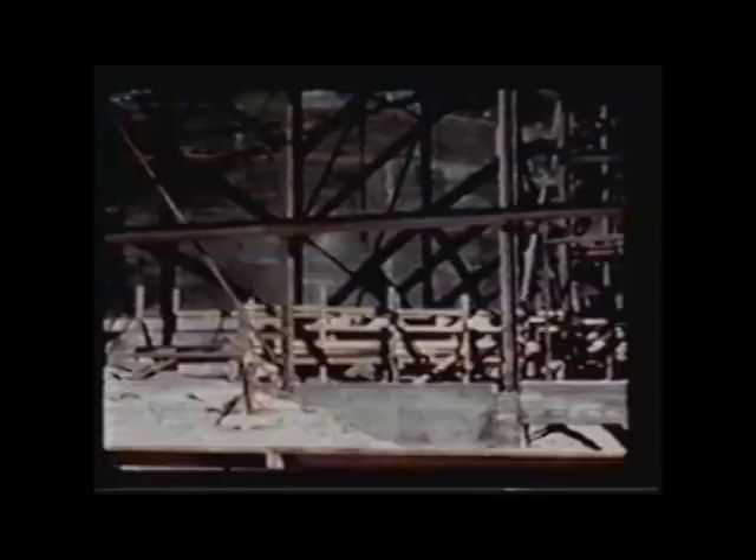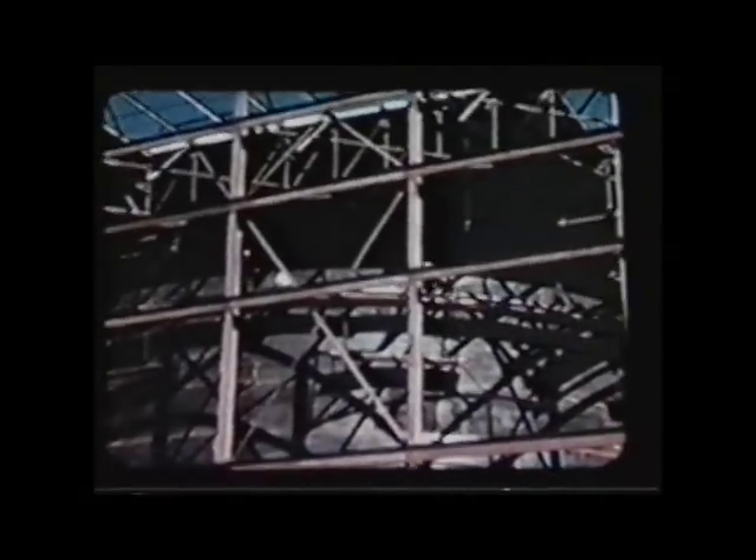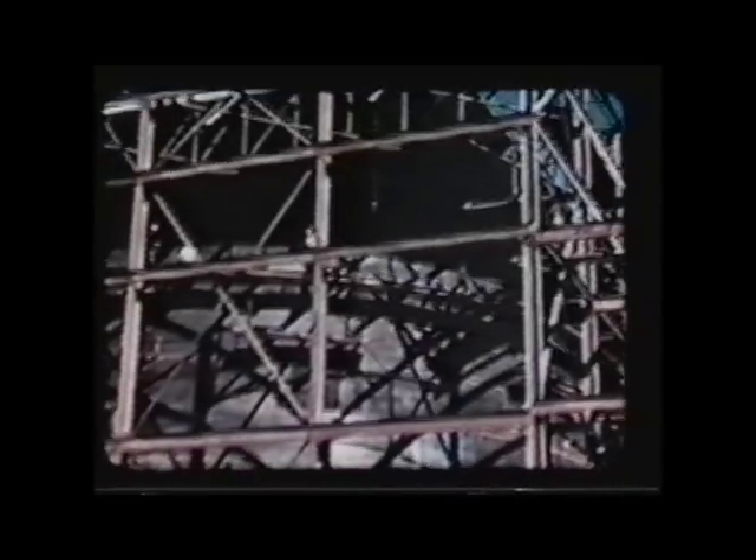This was the main pump house that sent water to the reactor. It had not only electrical pumps and backup steam pumps working together, but they actually built heavy flywheels into every pump — many tons, tall flywheels. In the event that they lost all power, the water wouldn't cut off immediately. The flywheels would continue to pump long enough to keep the water moving so they could get another system going.